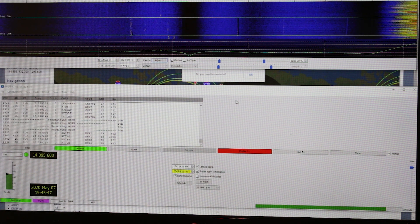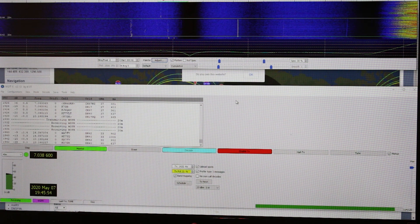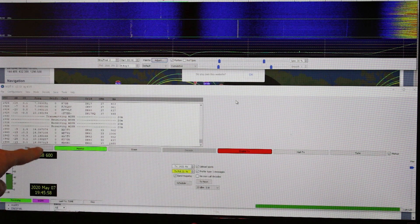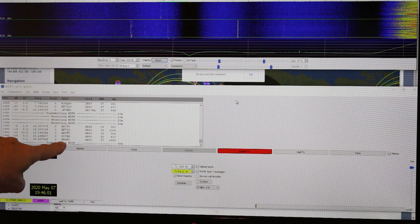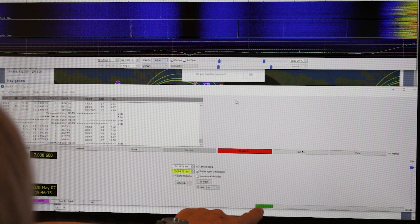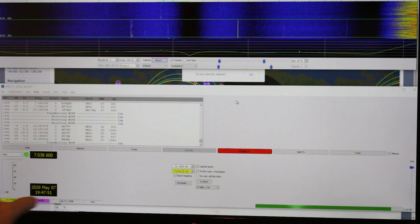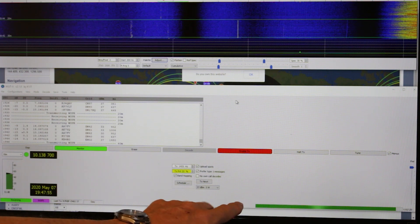Right now it's receiving on 20 meters. Looks like there's a faint one coming in on 20 meters right now. As soon as it's done receiving, it will switch over to another band or transmit. Two-thirds of the way through — it's going to decode any second. Decoding, blue. And it says on 14.097 it received one signal: KB4RG. Now it says it's transmitting WSPR. You can see down here in the left-hand corner it's yellow, and it says transmitting N7RBP with my grid square. We're currently at our lowest power level of 5 watts.